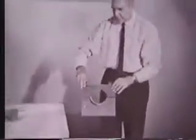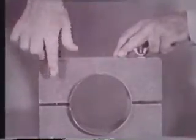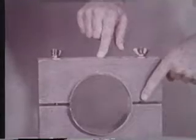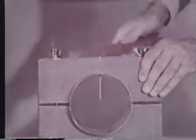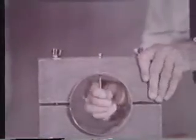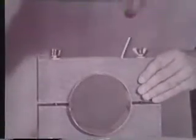Note that the two wood blocks being separated never touch, and thus the thin walls of the can actually support the man's weight. Next, take the subject of concentrated live loads and impact. A nail driven against an unsupported coffee can conduit would buckle it. But when the conduit is uniformly supported in this simulated uniform fill, the danger of buckling is eliminated.